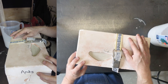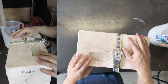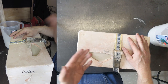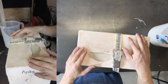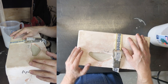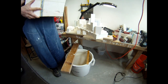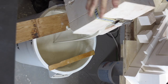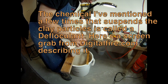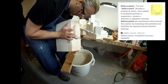We're going to leave this for half an hour and after that I'm going to pour the slip out. The liquid center that's not gelled or part of the skin is still just liquid clay inside — I'll dump that out and let it rest, then open it up and take a look at the shell. I mixed the slip using a recipe just like baking — different dry ingredients scooped from big 50-pound bags, mixed with water and the chemical that suspends the clay particles. I use a big drill to mix.